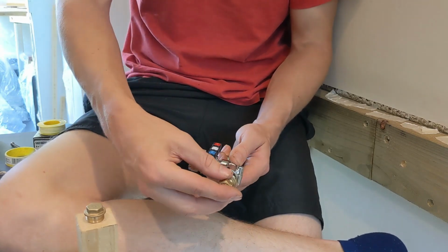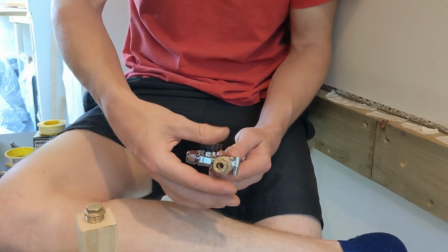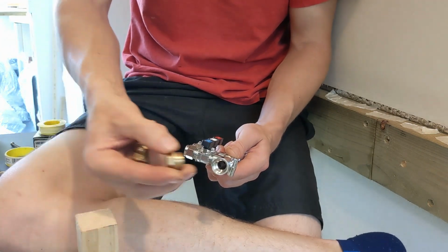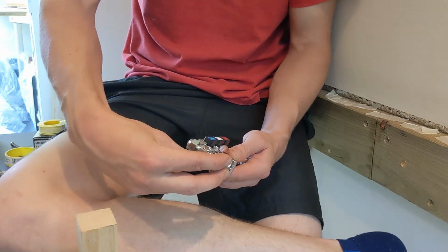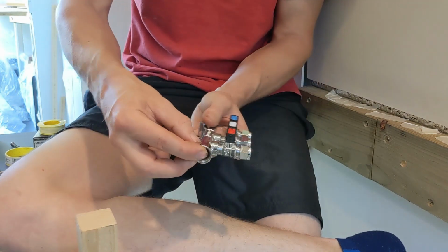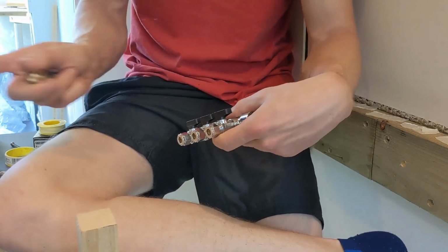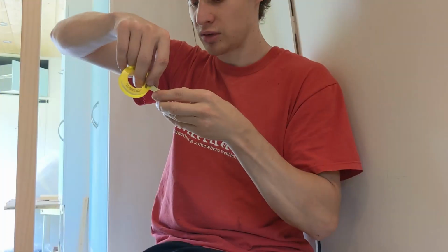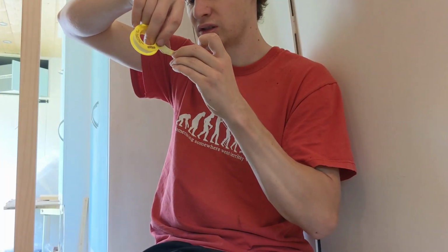And then it came with these end pieces, so one of them is an 8mm copper pipe into it, and the other option we've got is a blanking cap, and that's so that you can change it so that it goes out left or right depending on which way you want it to face. But we're going to put some gas safe PTFE tape on these because they're threaded fittings.